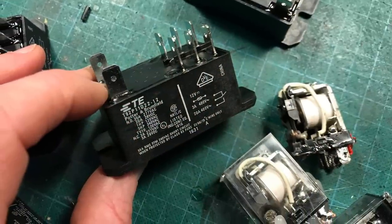And I changed the small relays to three times the power. They're supposed to be able to break 30 amps of alternating current. And the first relays I used could break, I think, 10 amps of alternating current, but this is a direct current system, so it's a totally different thing. So you're not supposed to break any current at all, almost. But I think they will have a much better resistance for accidental action of the reverse switch than the first relays that I used in this vehicle.